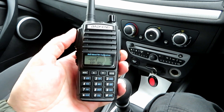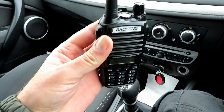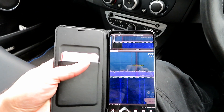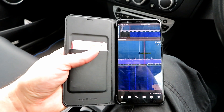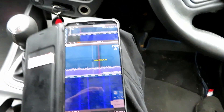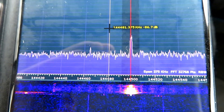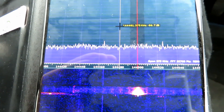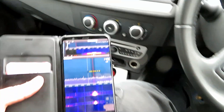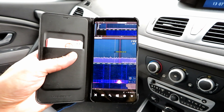I could use much better radios like an ICOM or Yaesu, but the whole point was to try a repeater test using budget Chinese radios, and the front ends on these, as is well documented, aren't great. I've now moved antennas — the receive antenna is now on the side of the house and the transmit antenna is in the shack, and it seems to be working a lot better. I'm about a mile and a half away sat in the car. G7LNK testing — and you can see there's a slight delay, just enough to record. G7LNK testing repeater access. So that is actually working now. The trick seems to be the receive antenna on the outside of the house and the transmit antenna on the inside.